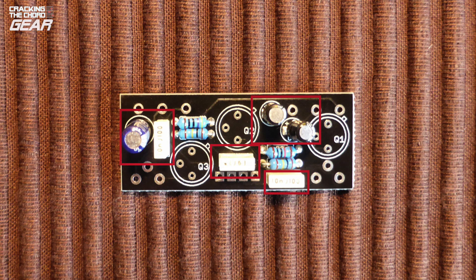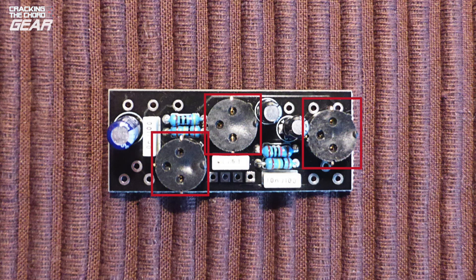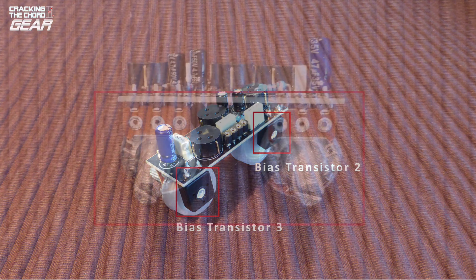After ensuring that all the resistors and capacitors were in place, the next step was to install the transistor sockets. Sockets didn't come as part of the kit but I feel happier using sockets — which you can buy on eBay — rather than taking the risk of burning the transistors with a soldering iron. Since the holes in the PCB are designed for transistor leads I had to file down the feet of the sockets to fit the PCB, but that wasn't too onerous. The bias for transistor 3 should be adjusted by setting the resistance of its trimmer pot to 8.2 kilo ohms before it's installed, and this was checked with a multimeter. I set the transistor 2 trimmer pot wiper to the centre before installing. With both trimmer pots soldered in place I then soldered the volume and attack pots in place.